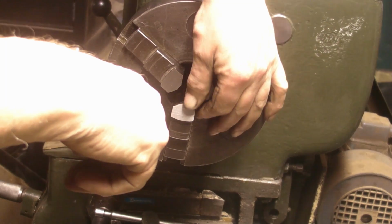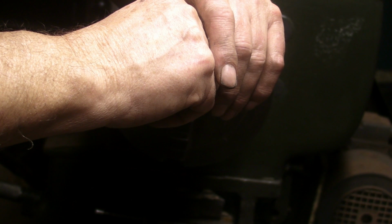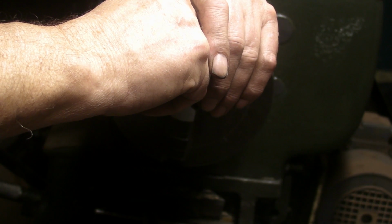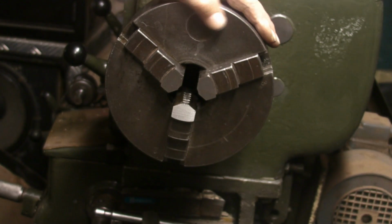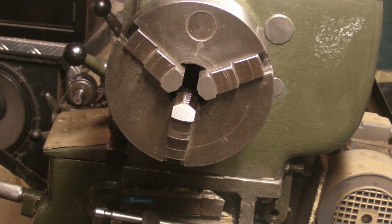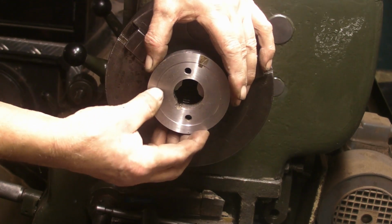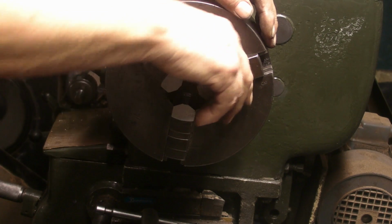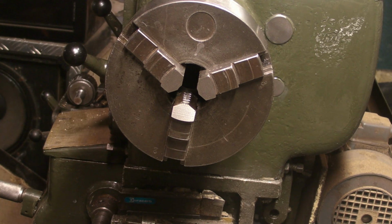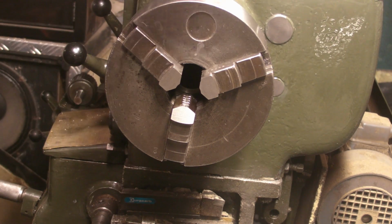Well, guys, back to the three jaw. I'm just wondering if any of you out there have got any experience about how the jaws are ground when they're manufactured, and what process they use. From what I've seen on the videos, I think the agreement is that the three jaws should be preloaded in the closed position. I have seen people using external rings that go on the outer face of the jaws, but then I'm not sure if that takes into account any play that's in the scroll when they're in the open position.